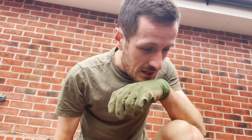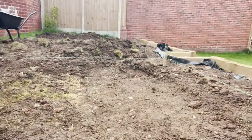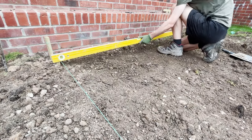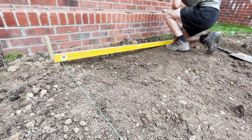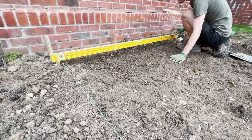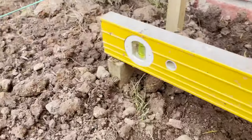That's hard going — really hard. In hindsight I probably should have chucked all the soil on that side over there, but you live and learn. I didn't think about what the level of the patio was going to be when we started. So what I'm going to do now is knock in the next three posts and get them level with these — and by level I mean not completely flat, but enough of a slight slope so that water can drain off the patio when it's in place.